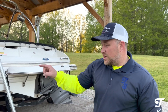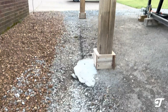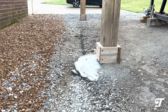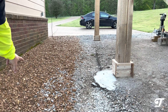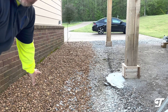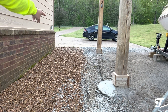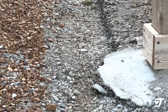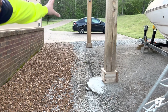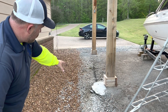Let's talk about some things we're going to have to fix. There's a lot of water that rushes off that driveway, which is why we created this area with washed gravel — not crushed gravel — so water can travel through. But it looks like the water really wanted to take this path right here too. It's a very easy fix; it didn't change the integrity of the structure, the posts are still just as strong. We're just going to put a little more washed gravel in the mix.